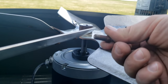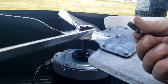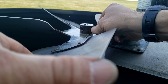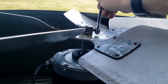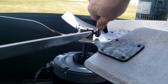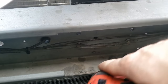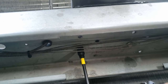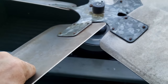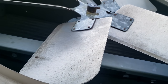That's a real fine thread — I didn't have any bolts that would match that. So I'm going to put it on the key side since it's not really doing much more than holding the key there, and the other one here is the one that was better — it's going to hold it mainly against the shaft. Still got to tighten up these nuts on the motor mounting. So we got those tightened up — went ahead and used number three setting on that impact, it broke them loose, so I figured I should be able to make them tight enough. But we'll double check them with the wrench just to make certain. Got plenty of clearance all the way around. We're going to verify rotation and should be good to go here in just a second.